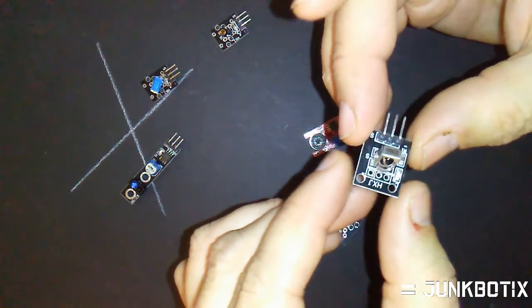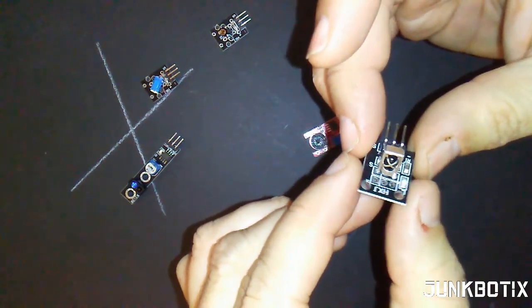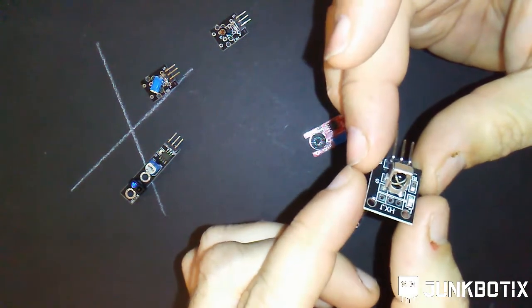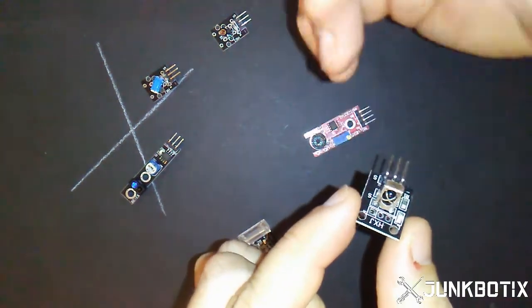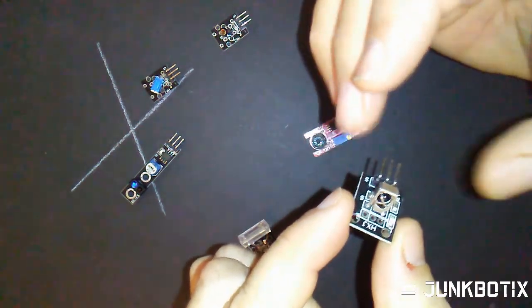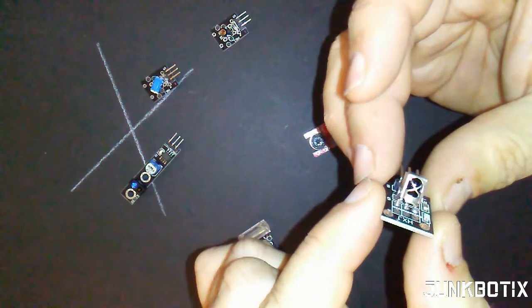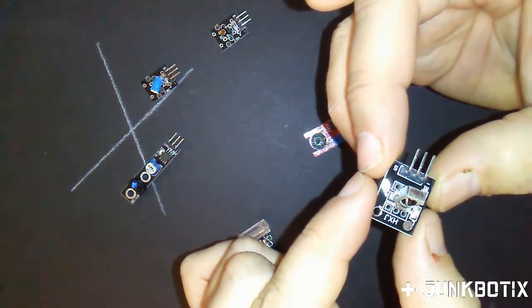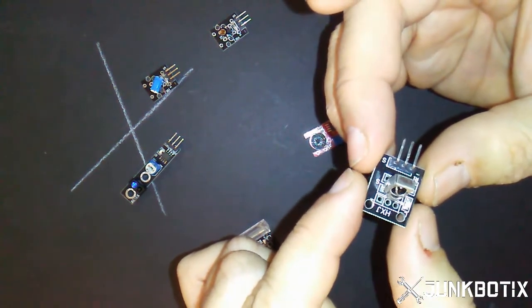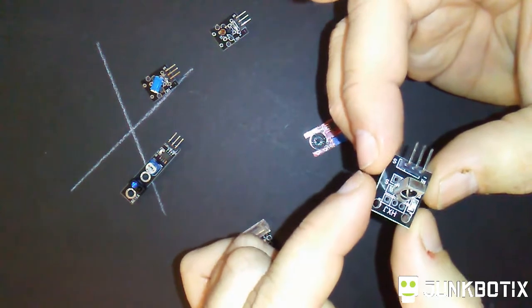This one here is an IR sensor mainly meant to sense remote control signals. You could take a remote control from a television or something else that sends out IR signals, and sense them with this little module. Those signals go back to the embedded system, where you can interpret them to control your robot by remote control.